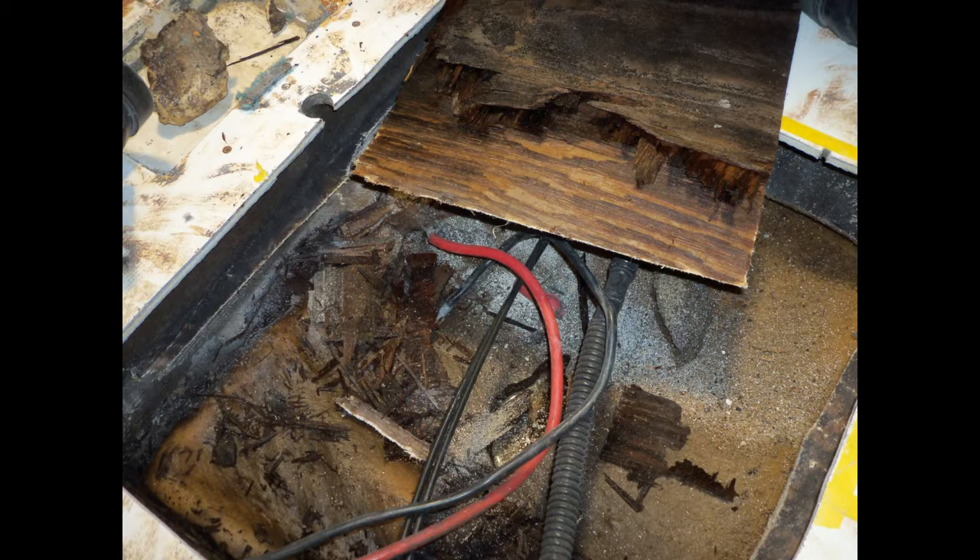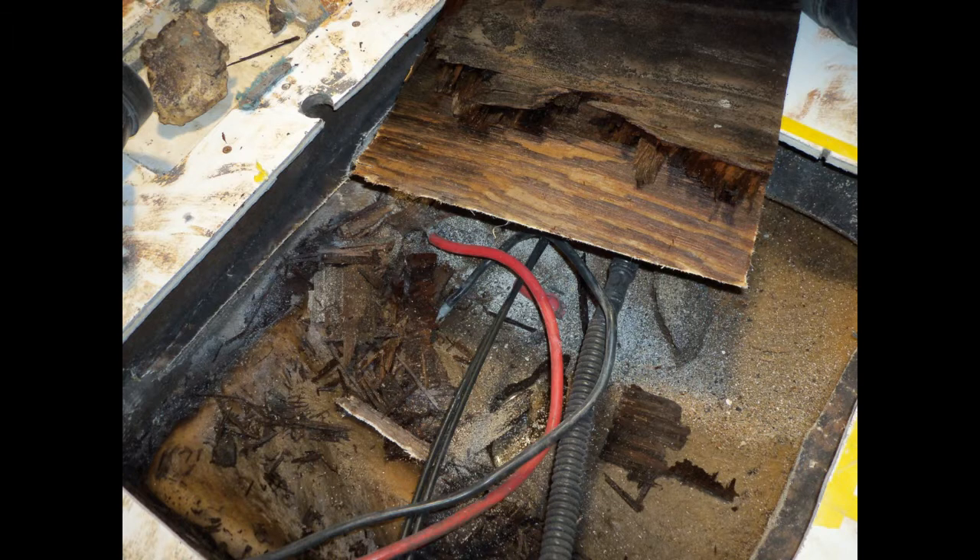With the foam box or subfloor cut out, we're going to find a good bit of rotten wood and a lot of water-saturated flotation foam and standing water — all trapped in this area. There's a bulkhead ahead of the pylon area and it's trapped water up in the forward area, so that bulkhead is going to be removed. The wet foam is going to be removed, everything cleaned out, and all this trapped water will be evacuated. With the bulkhead removed, it will be allowed to drain and will never get trapped again.